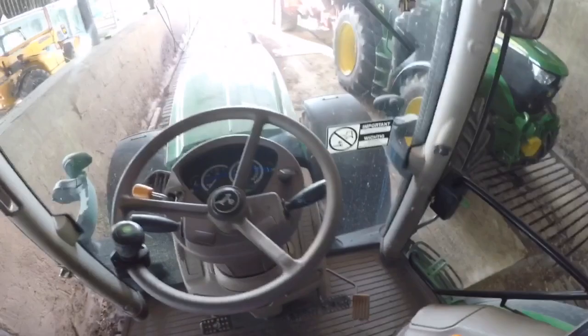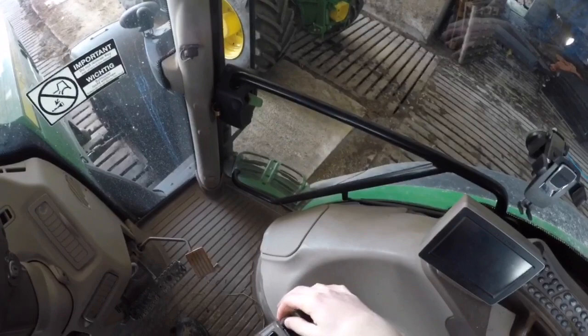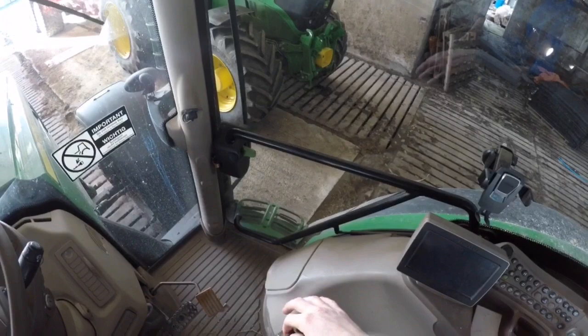She has four electric spools. That's them all in float at the minute — they're not sitting anything. That's them all out of float and that's pumping. That's pumping and that's releasing — pulling back and pushing forward. Then you push them down for float.